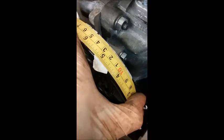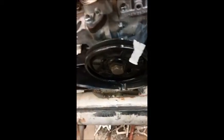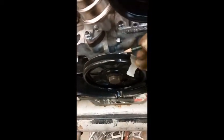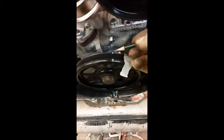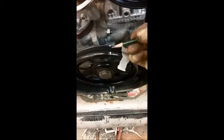I'll punch that with a chisel. You can see I have my TDC marked real nice here — I've got a white stripe across here. I actually hit that with a chisel and then hit it with a file to groove it on both sides of the pulley.